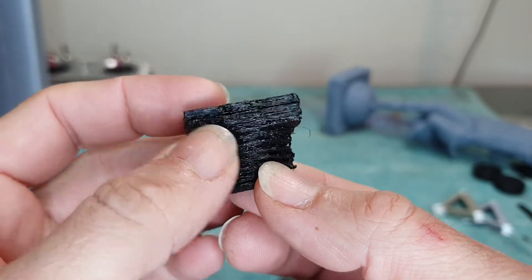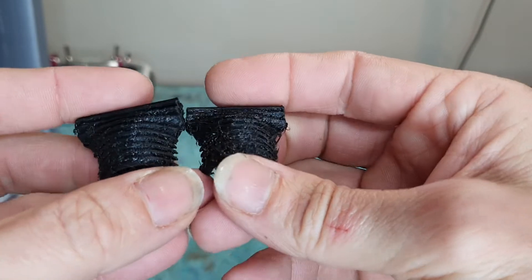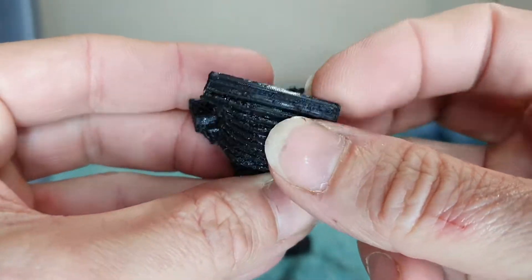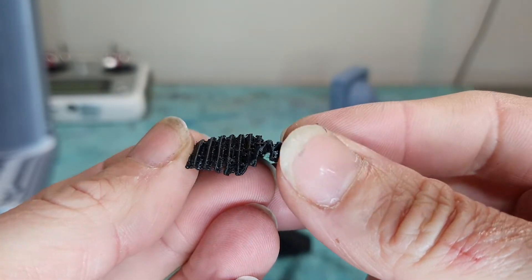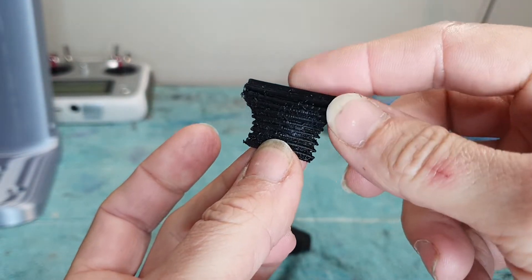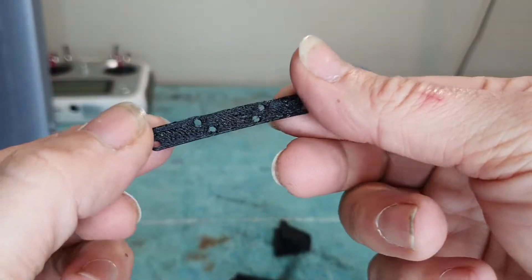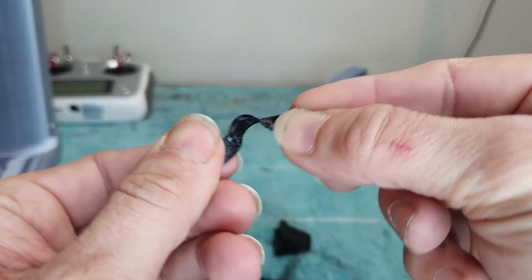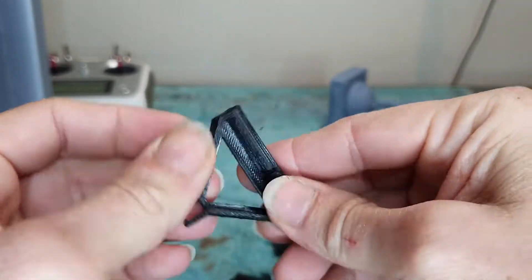The upright orientation wasn't the best print either. On the third one I did two more printed downwards — this uncleaned one was printed that way. This is the cleaned-up one: I got a pair of tweezers and just pulled off all the strings, then got a lighter and singed off all the excess hairs. Not bad — and TPU is flexible, which I needed since this part has to move in the chest and waist area of a particular model. I also printed a track pad off — it seems to like flat pieces a lot better. Nice strong rubber.